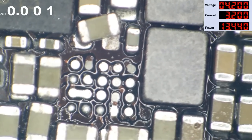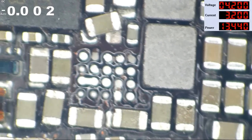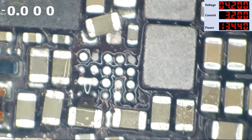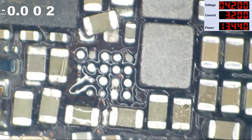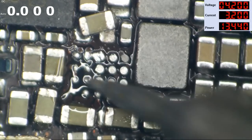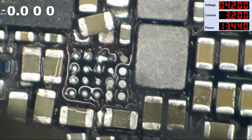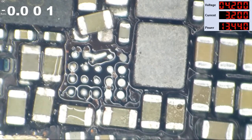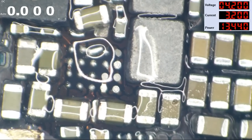This is going to be why the phone is not powering on, but it's not why they were having issues with image, and it's not why we won't have touch. Let's fix all of those things so I can get this guy's data. First thing I'm going to do is fix this solder bridge — it doesn't look like it's got enough flux, so let's give it a little dab. I'm going to clean up this whole entire area because I'm fairly confident we're getting data. We can't get data without this chip; we won't get an image on the screen.